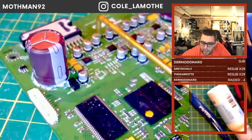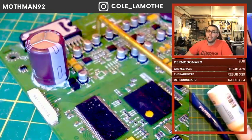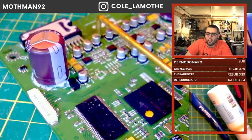You know, Rain, that is an excellent question, and it largely becomes a question of how acidic the electrolyte is, which was a really big problem in the mid-2000s. We've talked about this previously, but there was the capacitor plague of the 2000s, which largely came down to corporate espionage gone wrong. A capacitor manufacturer was developing a new electrolyte. The formula was stolen, written down incorrectly. It functioned, it had slightly better performance, but it was a lot more acidic, and it shortened the lifespan of capacitors substantially. And when they leaked, the electrolyte was so acidic, it actually ate the traces right off the board.